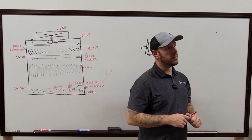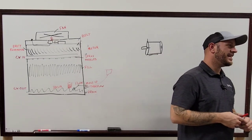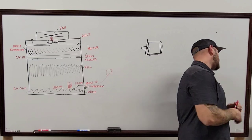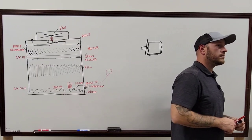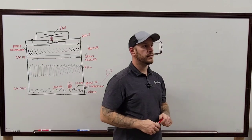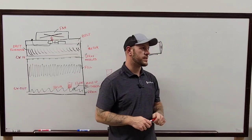Then you start getting outside of all kinds of stuff. Start getting past the cooling tower now. I mean, it's connected to all of it. All of it's connected back. And all the tower is, for anyone, is basically just a big condenser. That's all it is. All it is is releasing heat. Don't let the tower scare you in any way just because it's big. Well, I mean, just think of your everyday residential split system. Yeah, it's doing the same thing.